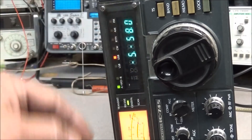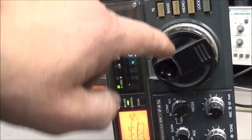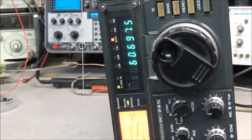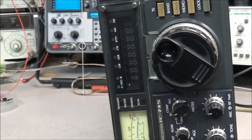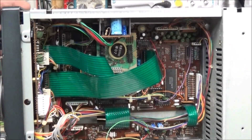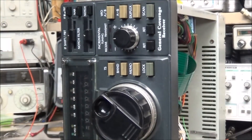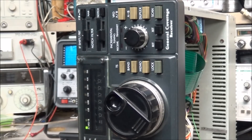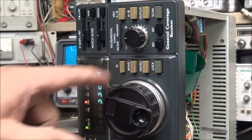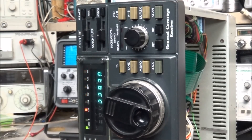When you try to go through the modes, it comes up with different things. If we try the bands, it pretty much rocks on one frequency. Without the battery in the RAM board, the radio is useless. Now my RAM board is back installed. I'm going to turn the radio around, hit the power button, going through the boot — and there we are. I'm going to go through the bands and through the modes, and you can see the offsets are changing for the different sidebands. That's how it works.